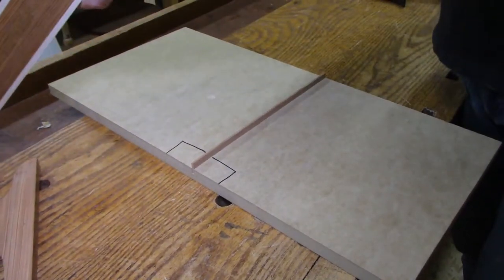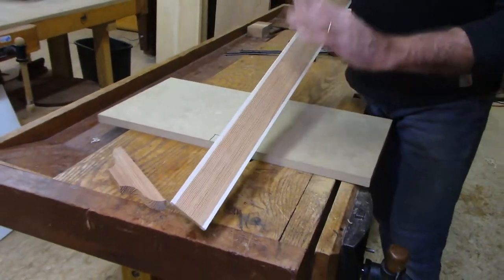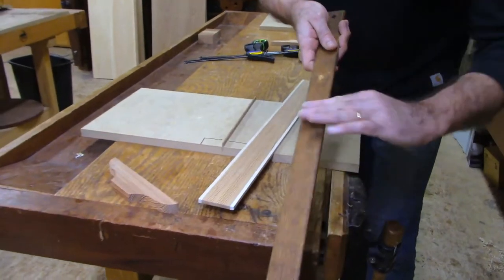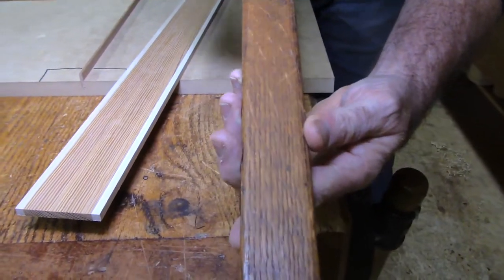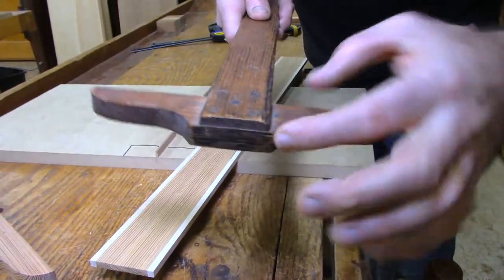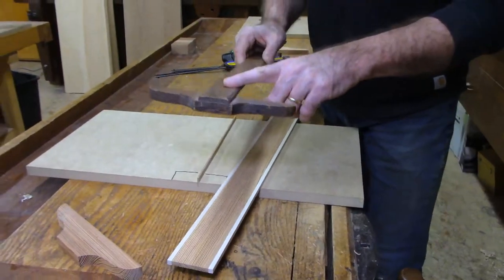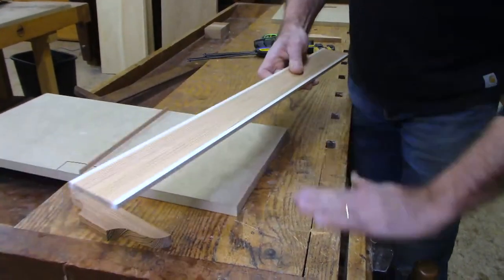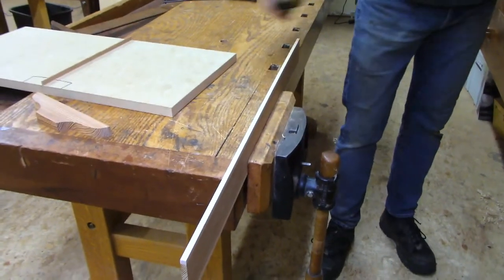As I went to put this on, I thought this could be a little improved — it's kind of a hard edge. I thought this would be nicer with a faceted edge. Look at the old one — it's a little rounded over, almost looks hewn. This is quarter-sawn oak, probably white. Up by the beam head you see the original profile where it didn't get worn so much, and down here it's pretty worn. I wanted to create a chamfer very simply — nothing fancy. You don't have to set up a router. Just set it in your vise, get a little block plane out, and have some fun.